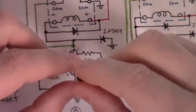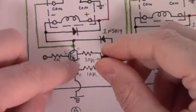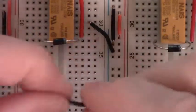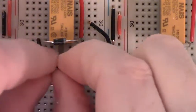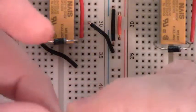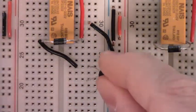Let's add these to the board. We'll add a wire from the ground side of this coil down to the collector of this first NPN, then add a second NPN in series with it. The emitter of the first NPN will be in the same row of the breadboard as the collector leg of the second NPN. We add our piece of wire from the low side of the coil to a row in the breadboard, then add the collector of our first NPN — in my case this leg with the flat side to the right — into that same row.